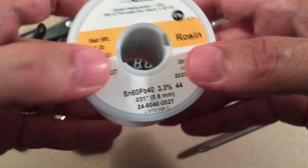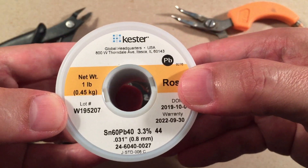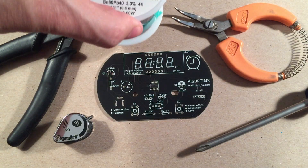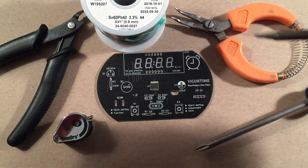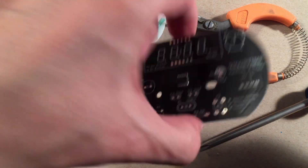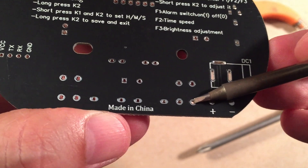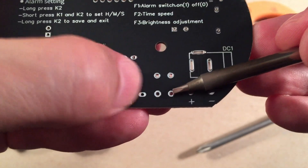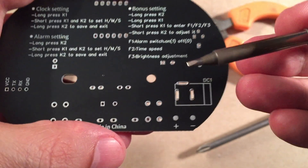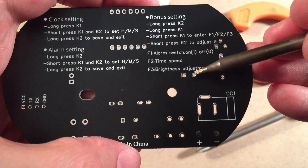This stuff is easy — low melting temp, this is the stuff you should be using. It does have lead in it, so if you're nervous about lead you can wear protective gloves while soldering. I've never had an issue — I've been soldering since I was a kid, and I'm old. For the soldering iron, I'll probably be using a screwdriver blade tip — this size is perfect for the pads. What you do is touch the pad and touch the leg, then put your solder on the opposite end and it will wick into the joint. Spend only about one to two seconds on each joint. If you're spending too much time, your iron is too cold or it's dirty, so clean it — and you can also add some extra flux if you have some.